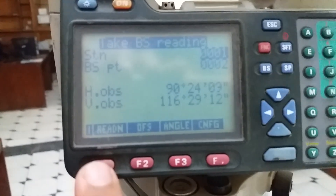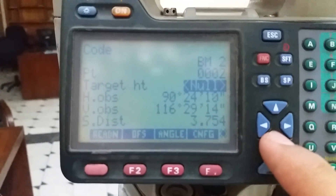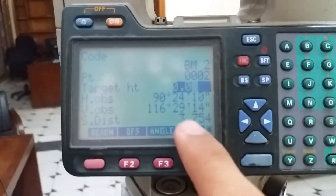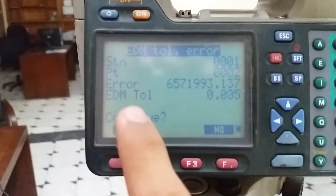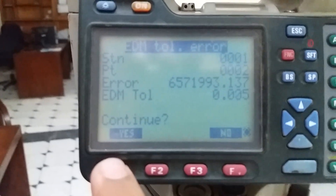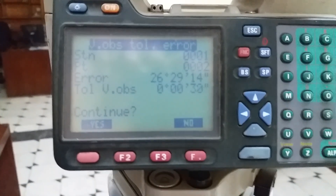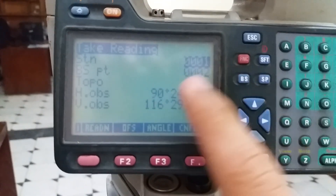This is my second benchmark backsight point. I will focus on it and do a reading. Target height — since it is not a prism but a laser, we give the target height and then enter it. You can check here — there is an error. The error is shown and we will accept it. There is also an error in vertical and horizontal angle; we accept it. Input accepted.